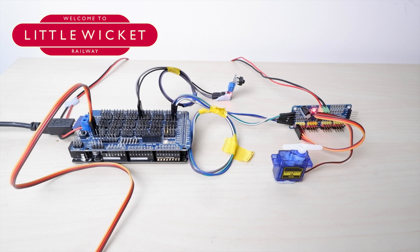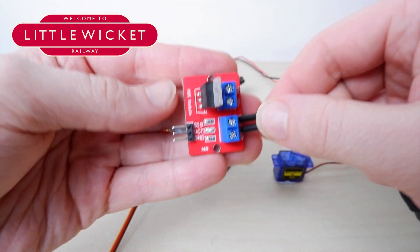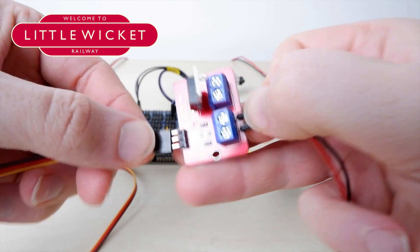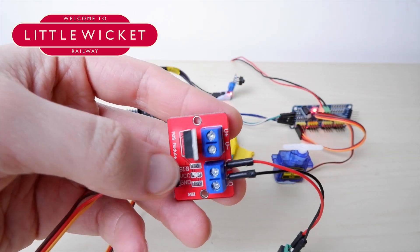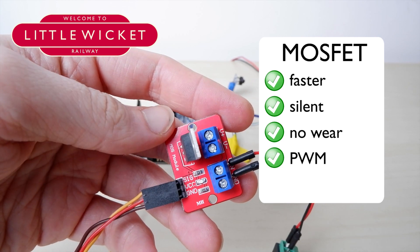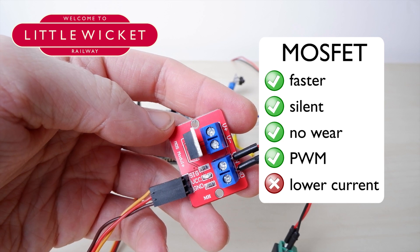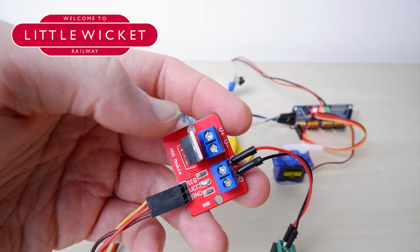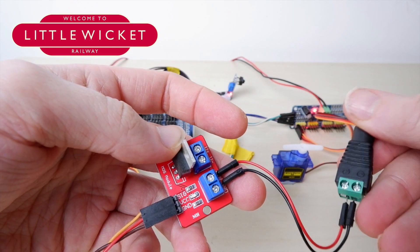However, because these LEDs only need just over 200 milliamps of current, I think there's something better we can use. This is an IRF520 MOSFET driver module. These cost slightly more than the relay modules but are still around £1 each. Again we've got the three-pin connection for the Arduino on the bottom, but instead of a physical switch we've got a MOSFET — Metal Oxide Semiconductor Field Effect Transistor. Effectively it's a switch without any moving parts. The benefits over relays are that they're faster, they don't make a noise, and they don't have any mechanical parts that can wear out. Plus they can be used with pulse width modulation for dimming or motor speed regulation. One downside is they can only really handle one amp of current before getting hot and needing heat sinks, with five amps being the absolute limit — but that should be more than enough for most model railway applications. On the other side of the board we've got connections for the device we want to operate, and next to it connections for the power supply — I've got a 12 volt supply here. So we'll wire that all in now.